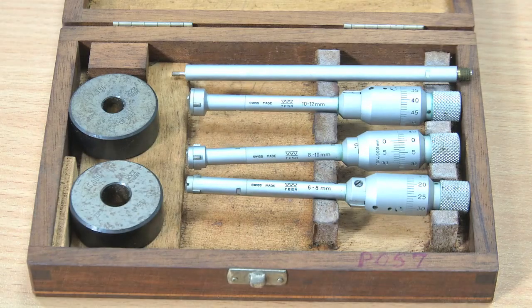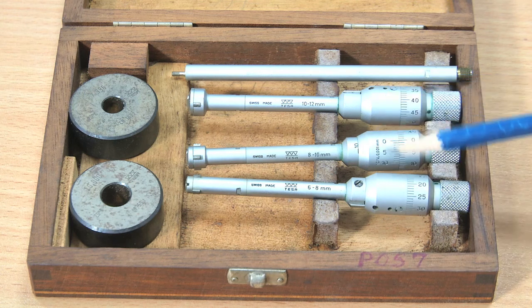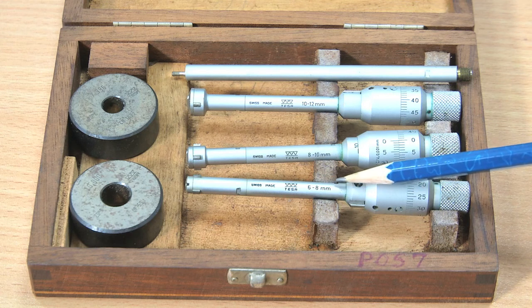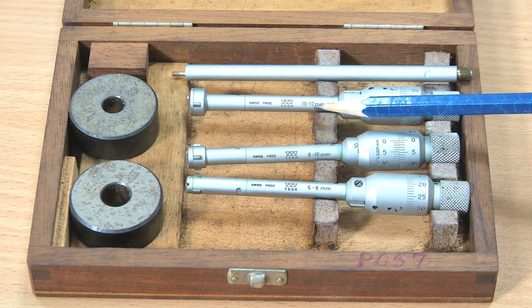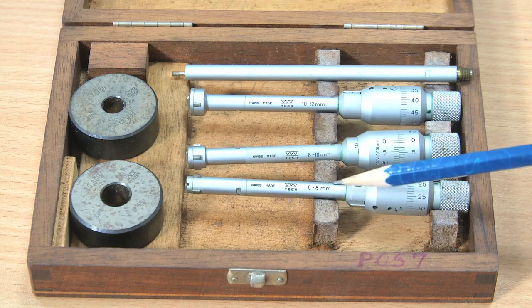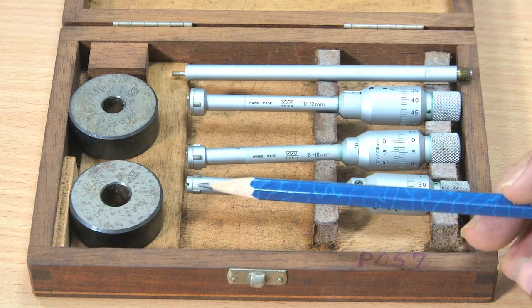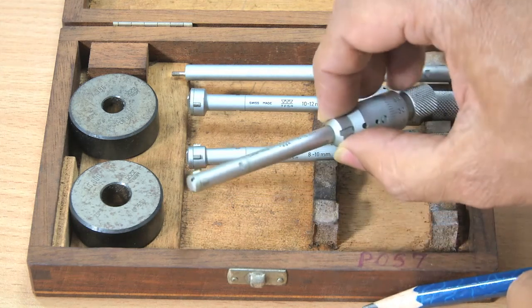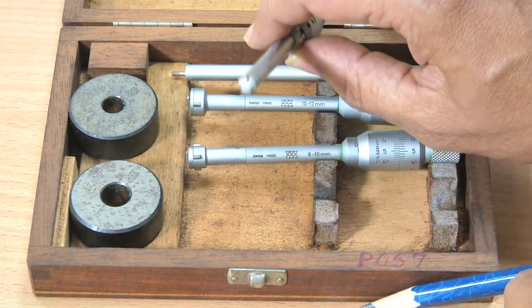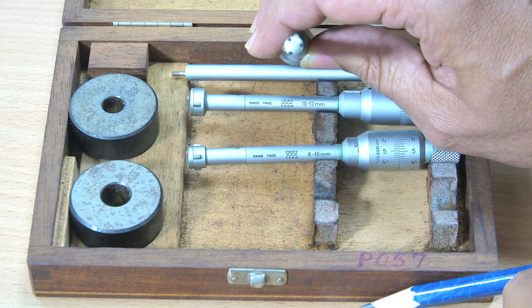Now, let us see the internal micrometers. Now, we can see the 3 internal micrometers are available here. The range is 6 to 8 millimeter, then 8 to 10 millimeter, and then 10 to 12 millimeter. Now, we can see the pins here, anvils. So, there will be 3 anvils. Now, you can see 3 anvils are there at 120 degrees apart,